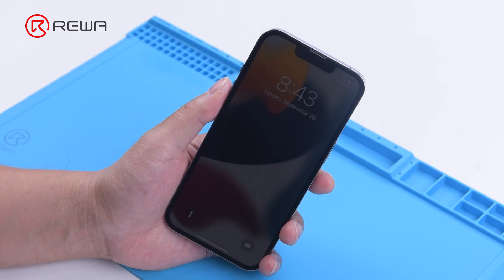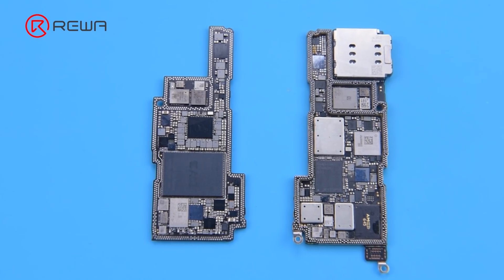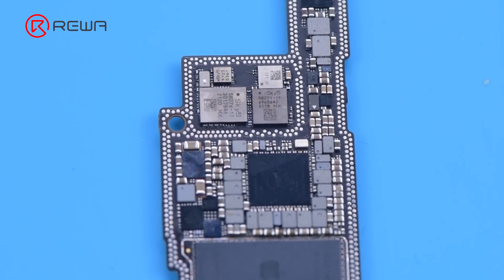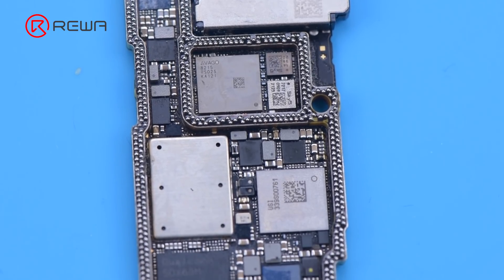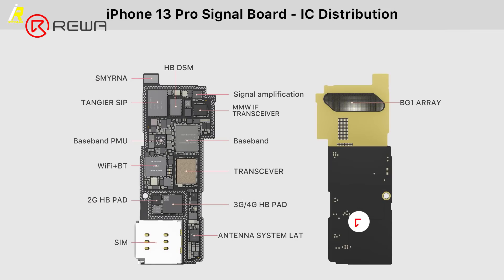In summary, through this separation it is found that iPhone 13 Pro still has a double-layered motherboard. The motherboard has some changes in appearance, but there is little change in the main chip distribution. Additionally, the CPU and baseband are stacked, which not only increases the difficulty of repair but also makes the motherboard heat up easily — under certain conditions, the motherboard is more likely to have problems. For your reference, this is the motherboard chip distribution diagram of iPhone 13 Pro from iRepair. Thank you for watching.